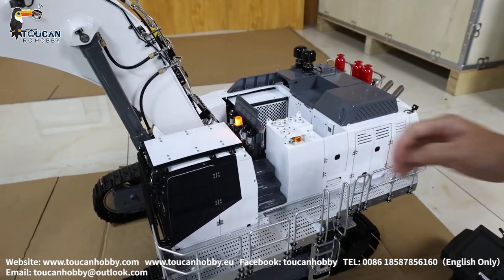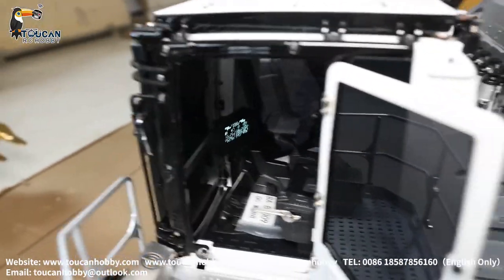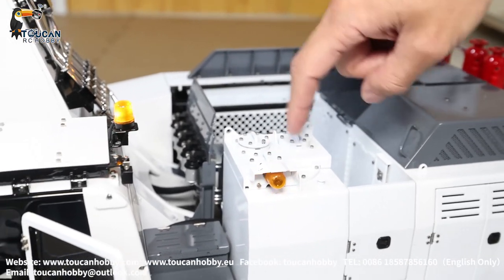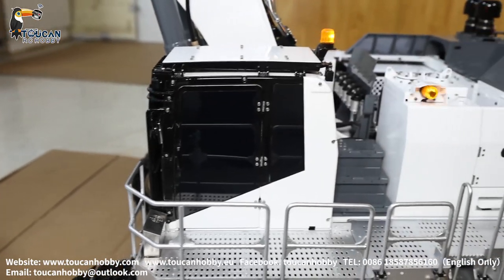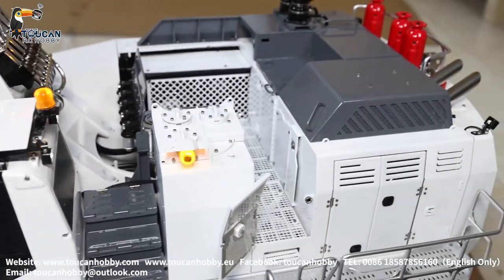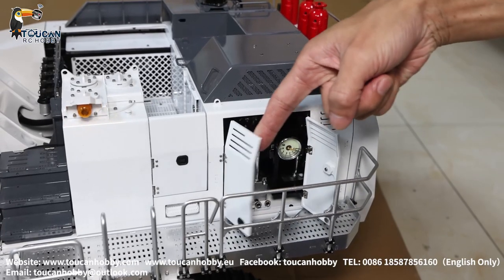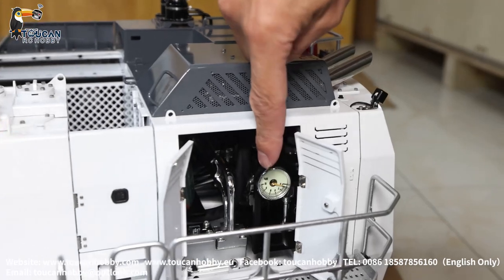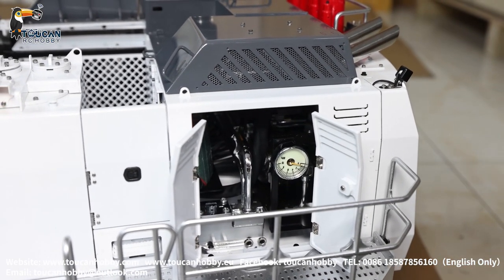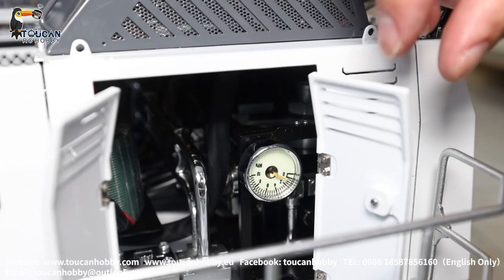Open the cabin — we see inside the screen is showing. The screen is showing the voltage: 12.1V. Also the oil temperature — in the tank they have a sensor telling the oil temperature. Here, this one can open — we see electronics inside. This door can open. Here the handle is inside. Open the door — inside we have the pressure gauge. This one is adjusting the flow. Start the pump directly and you can see the pressure going — it's almost 6 MPa. Close the door.